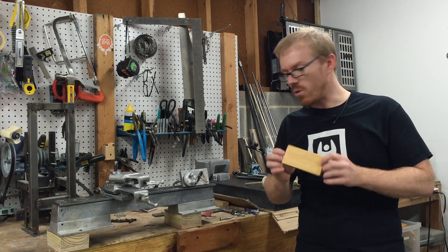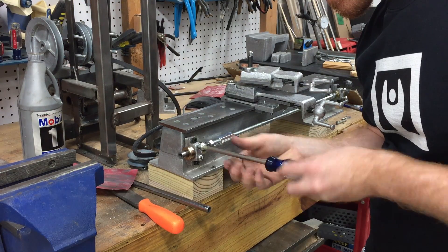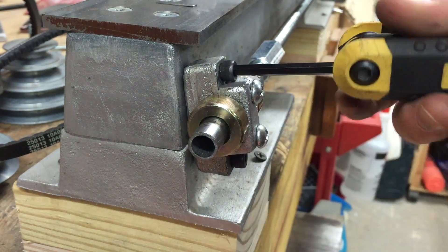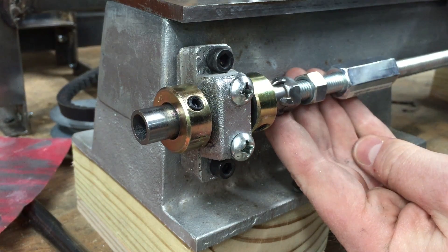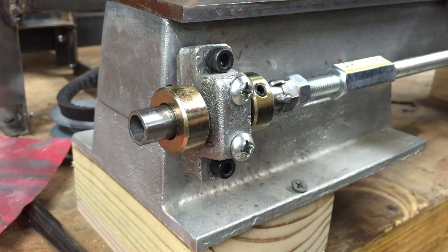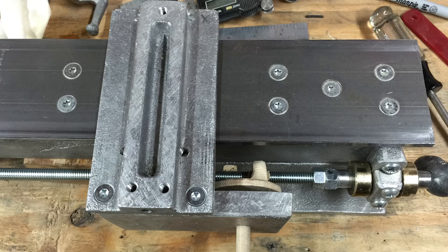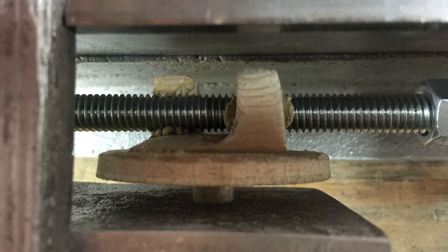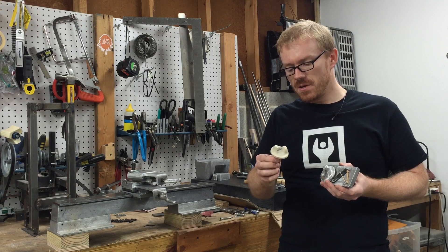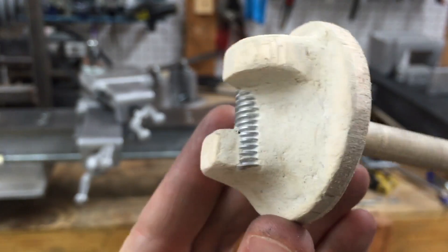The apron is just a square piece of cast aluminum, and I mounted it onto the base of the carriage. I had the lead screw assembled onto the lathe bed, and that allowed me to create the pattern for the split nut. I drilled a hole in the carriage at the same level as the lead screw, then used wood filler — spraying oil onto the lead screw first to keep the wood filler from sticking. Once it set up, I was able to finish the pattern, which gives you good alignment between the split nut that gets cast and the lead screw.